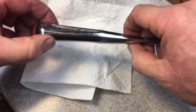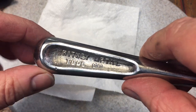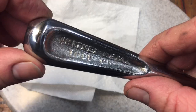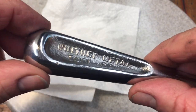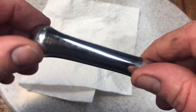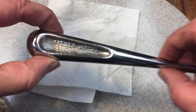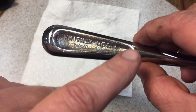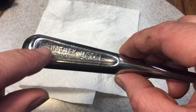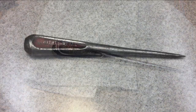We are done with the sanding, the polishing, the buffing. All we have to do is fill this in with paint. We took out some Comet — regular Comet abrasive powder — scrubbed it good in there, because sometimes you get that buffing compound in there. Scrubbed both sides real good, then did it with denatured alcohol. Now we're going to put the paint in here heavy and just use your finger and wipe off the excess, and that'll take off the excess from the letters and things like that. See what it looks like when we come back.